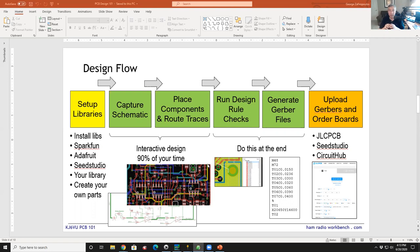And the thing that's really important about a professional piece of PC board design software is the notion of real-time connectivity, in a term that they call correct by construction. What that means is that when I go into the schematic editor, when I drop a part in the schematic, the physical part instantly pops up in the layout editor. If I have two parts in the schematic and I draw a line between two of the pins, in the layout, you'll see a line immediately draw between the two pins in the physical world.